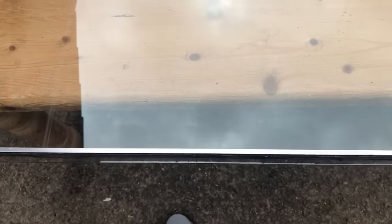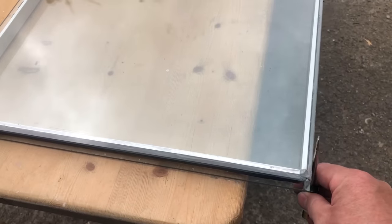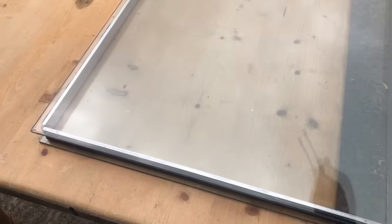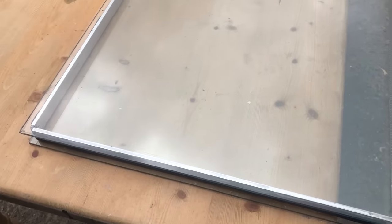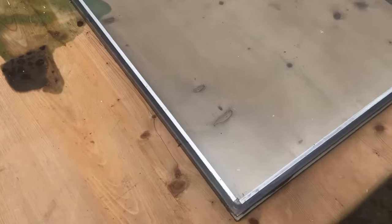I'll make the glass sandwich — just giving everything a quick wipe over with a microfibre cloth first. I've now got the glass pretty much squared up with the aluminium spacer containing the recently dried desiccant, and the interior part refitted centrally. I'm quite happy with this, though I might just tweak it a little before we get to the critical part.